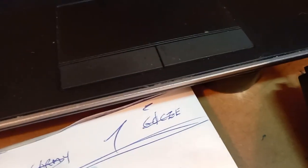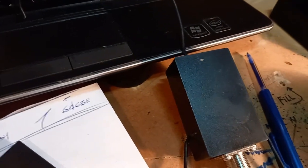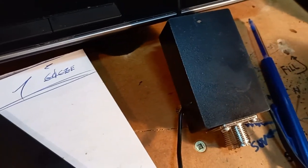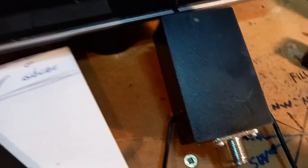Connect the coax and the coax then goes off to the shack. What I normally do on the coax, I do have an isolating one-to-one coil on the coax at the bottom. For the 20 metre one, I've actually got ferrite clamps on the coax instead of the one-to-one coil.